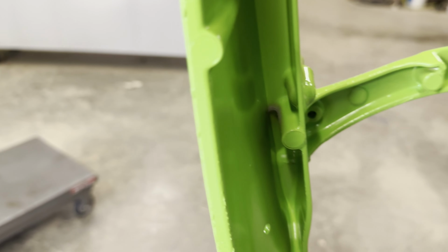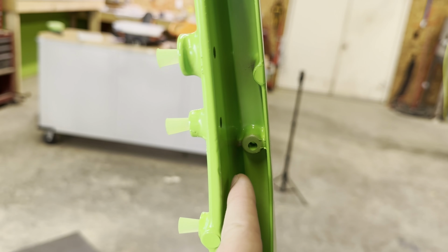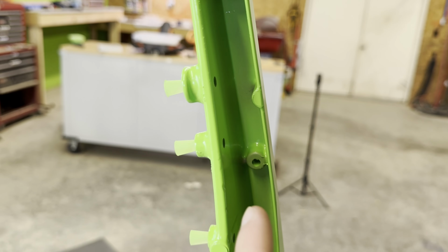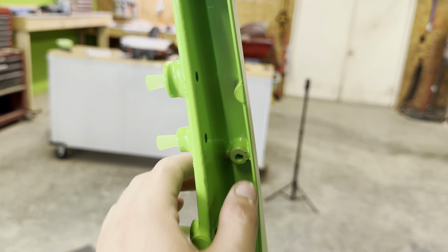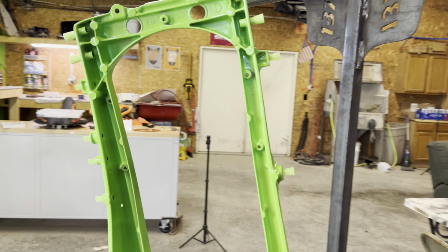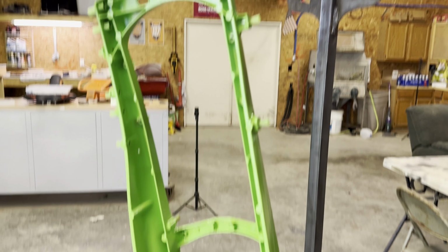And these are the hard places to get. They are what's called Faraday areas. What happens is you have a real tight area and that powder doesn't want to go all the way down in there, because when it gets close to that, it ends up sticking to the wall, or it sticks to a different part instead of going all the way down in there. So we really need to play with it. This is my very first attempt, really, at a part with a Faraday area.